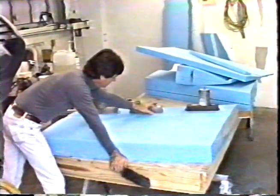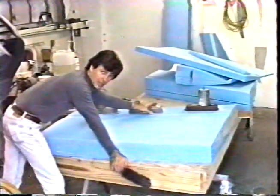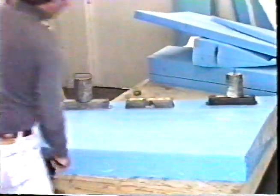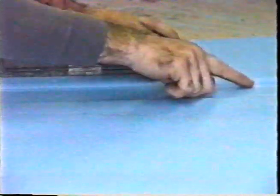That occurred right here. And Sergio, would you get a close-up of that, please? We're just touching in this area here. There was obviously a slight divot in the middle, but we are touching in the center, which gives us a very straight spar cap. And we can check that right here again. No gap. We're not really sanding foam in this area, from here to about here. We're just touching the upper edges.